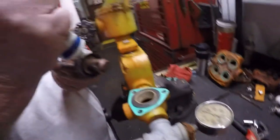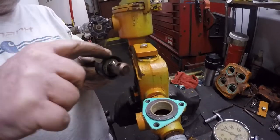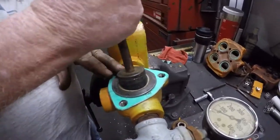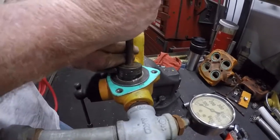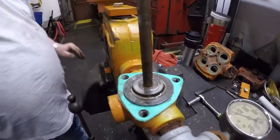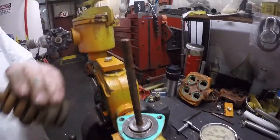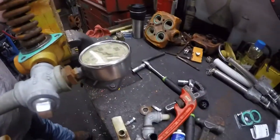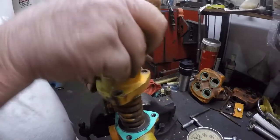Then take your regulator stem, put some grease around the packing, and go ahead and insert that back in. You may have to wiggle it a little bit — with the new packing it gets a little tight, so just make sure it slides down in and gives you a nice firm seal. Once we get that done, go ahead and replace the small spring and the large spring back on. Then take the washer and place that back on, then put the cover over top.